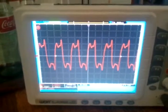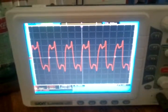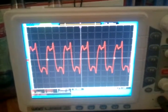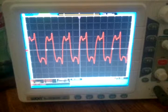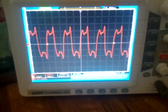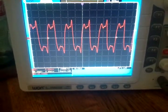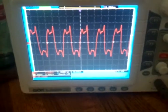As you can see there's a fair amount of noise at both top and bottom of the signal, but I don't think that makes much difference to the piezo, and this is enough to drive the piezo at nearly full strength as you can see. This is 5 volts per division on the display here, so we are getting about 20 volts of drive peak to peak there. So that's this morning's little adventure.